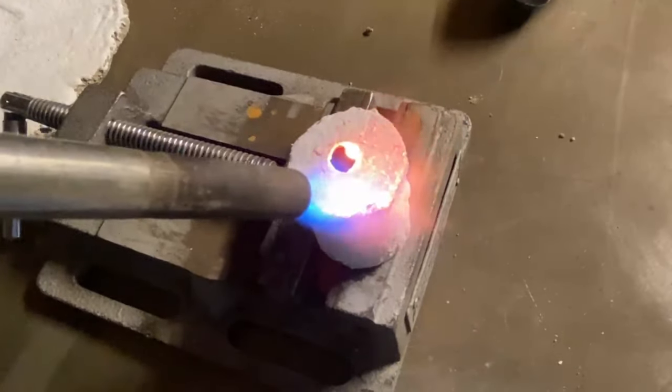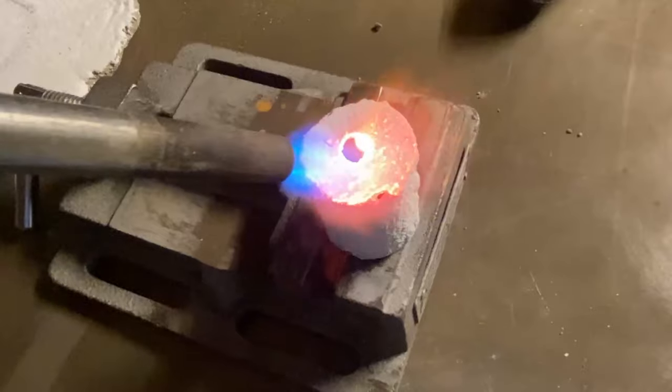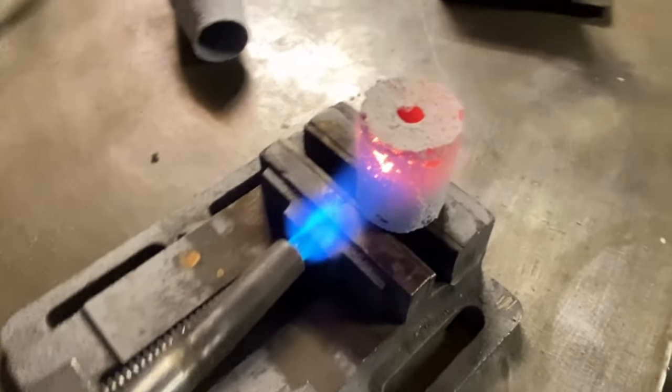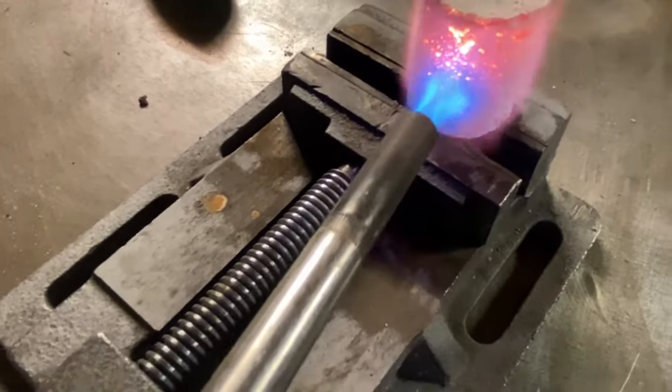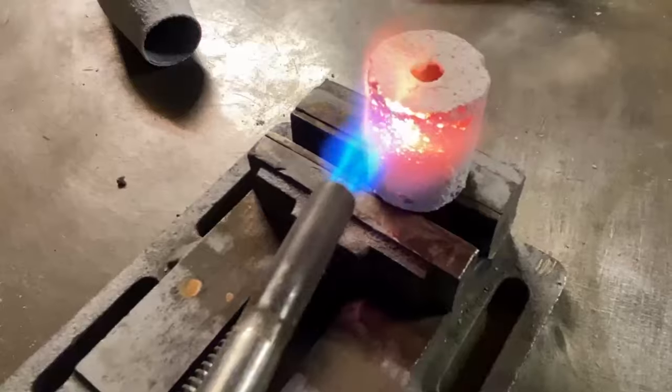Everything over here is hot. Half-hour run time. So I painted this piece of stainless steel without any surface prep at all — just a piece of metal I pulled off the shelf and painted a very thick coating on it. I did it the burnt egg style, where I got it hot and painted it on there when it was about 300 degrees. And it's doing pretty good.